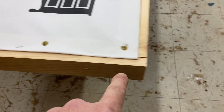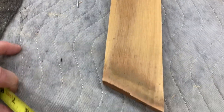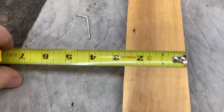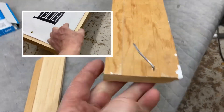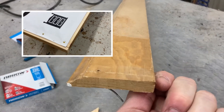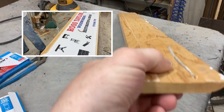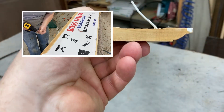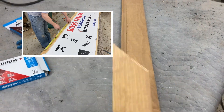Now I added a 1x around the edge. I found some old pine downstairs and ripped it to 2-1/2 inches. For the frame around the banner to cover the edge, I got some baseboard I had downstairs — it's a 1/2-inch baseboard and it's already got a little rabbet in the back. I ripped that to 2-1/8 inches.